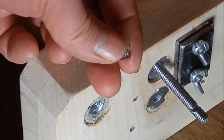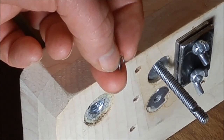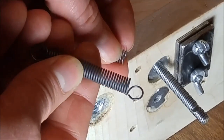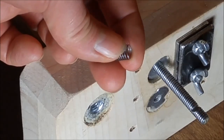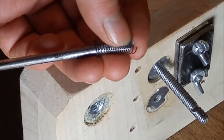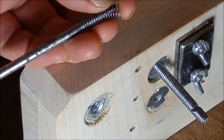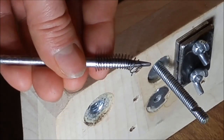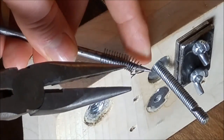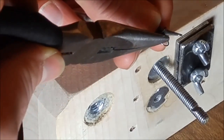If you want to make a tension spring or pull spring, what is typically done is you'll have a full loop of winding bent at a 90 degree angle on each side, like this. The technique I use is to take the end of a small screwdriver, run it through the spring, and isolate just the last spring winding that I want to bend over at a 90 degree angle. Then come in with needle nose pliers, grab hold of just that last loop, and while holding the spring bend it over at a 90 degree angle.